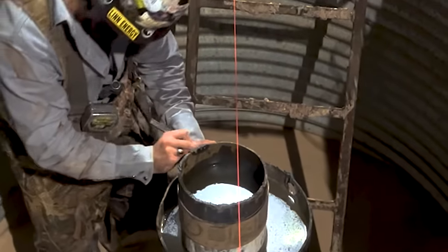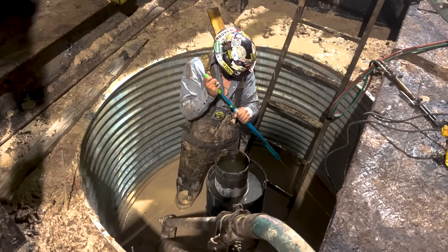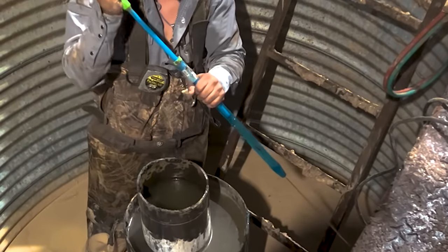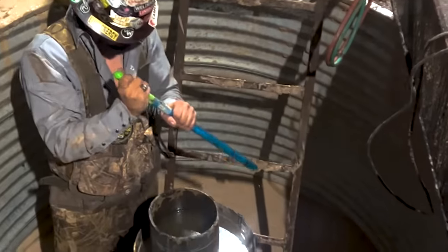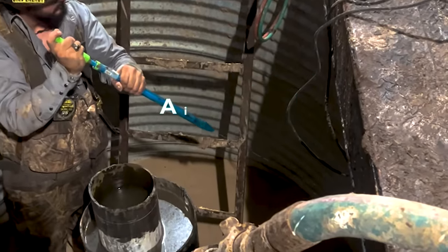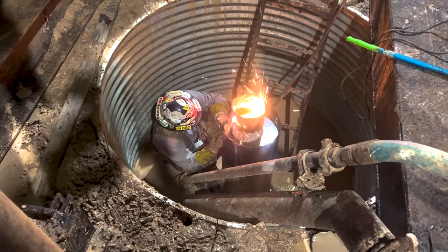You don't want to find out what happens if you mess this up — it's going to be several thousand dollars worth of damage. Now that we got our final cut measurement marked, we're going to get this water out of this surface casing. We don't want that water in there messing us up while we're cutting, or overflowing and losing our mark. Yes, I'm using a kid's squirt toy for the pool — there are other ways to do this, but this is just what we had and it works. We get that pumped out and I like to mark the inside of the surface casing so I can watch how high that water is going to rise.